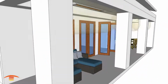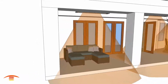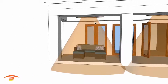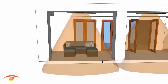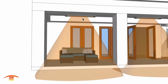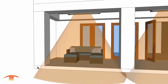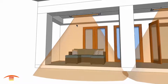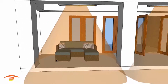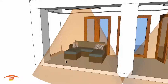All right, so let's go ahead and look at the overall footprint of heat throughout this space. And being that these heaters are going to be at that roughly 9-foot elevation, our footprint's going to be a little bit more compact in the fact that it's just closer to the ground. So infrared heating is a light wave. The light wave is non-visible to the human eye. However, it is a light wave, and it has a very specific pattern that is designed into the product, so that you have this heat pattern that comes down, and you can predict where the footprint will actually be. But being that it's closer to the ground, 6,000 watt, it's a little bit tighter to the floor.